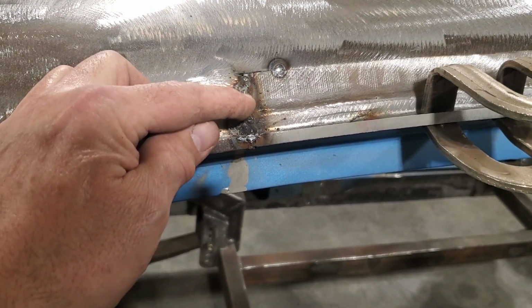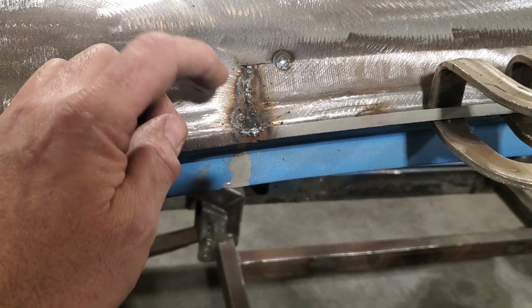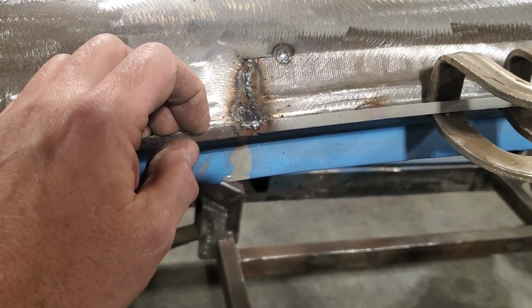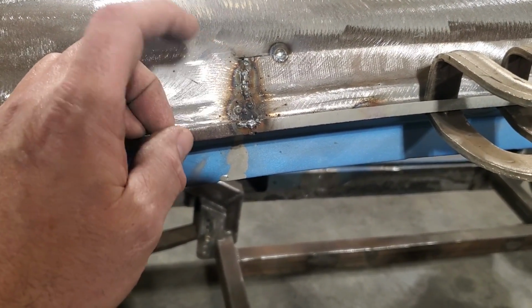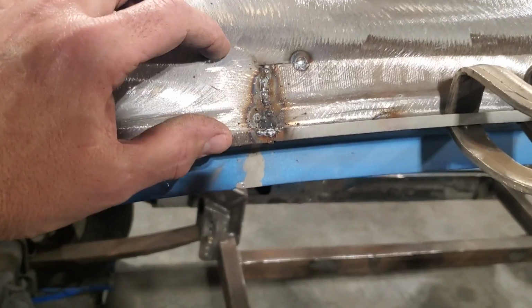And all I'm doing is I'm trying to build up around the outside of the hole that I got blown in it. And I just tap it, tap it, tap it, let it cool, let the redness go out of it, and then weld it up again. And just keep going like that. If you keep chasing it with a lot of heat in it, you'll be over here somewhere still welding it up, okay? Just got to take your time with it.